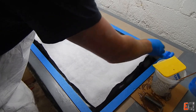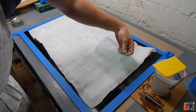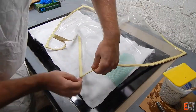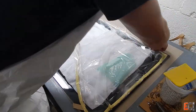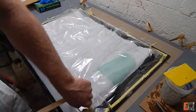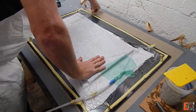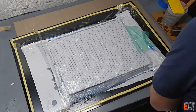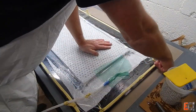I'm going to put that down and fold it over, just to give a little pat on the end. So that the breather doesn't get choked off with resin right at the edge of the panel, I'm putting a little bit of infusion mesh on there, and I'll land my vacuum hose right on that bit of mesh — it will bridge over and hopefully keep the breather from getting choked off. On this bag, I'm being pretty disciplined about the symmetry of the pleats, making sure I don't bridge anywhere. I pulled this down about 10 inches of mercury on the vacuum pump, and then once everything was down nicely after about 10 minutes, I gave it some more vacuum.